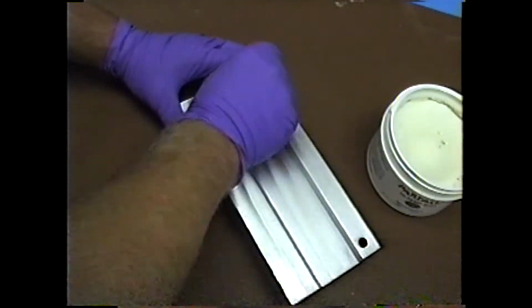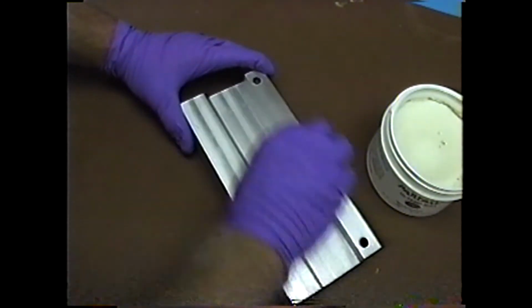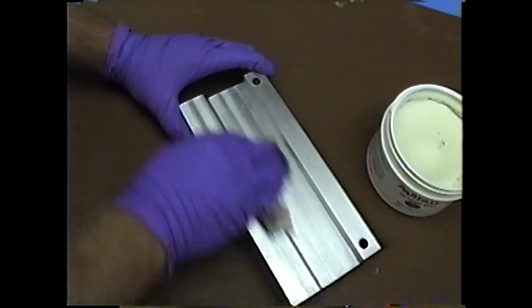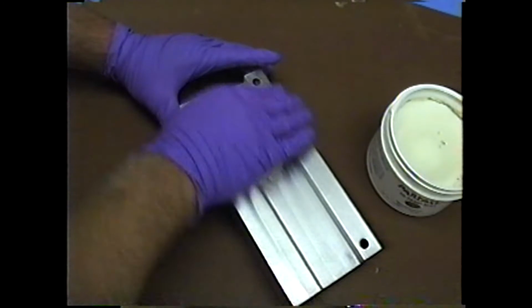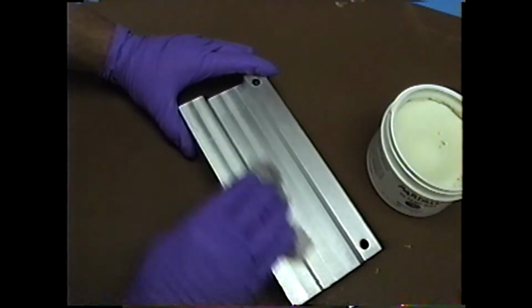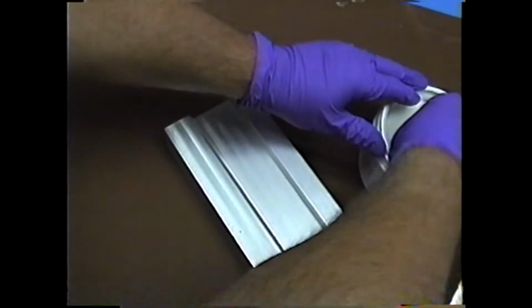The type that we're using is not really a hobby product. You're not even supposed to be able to buy it. There are only a few places that will even sell it to you without you demonstrating that you're in compliance with the EPA regulations. So keep in mind, this is not a product that we could make with 5-minute SIG epoxy. You need high-tech, very expensive, very specifically formulated epoxy. You just cannot get away with it. All epoxy is not the same.